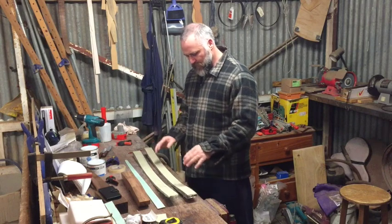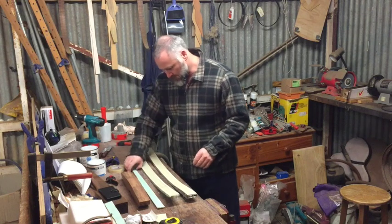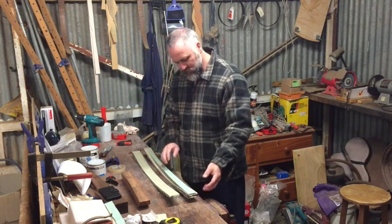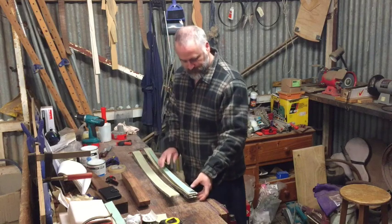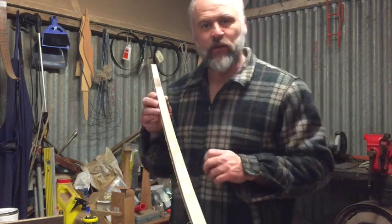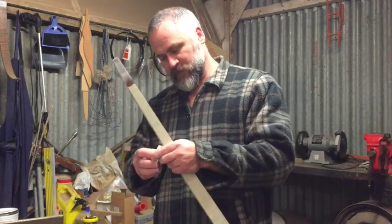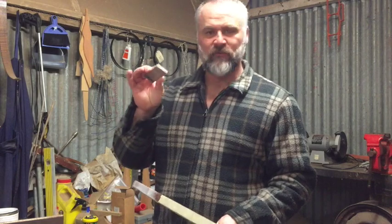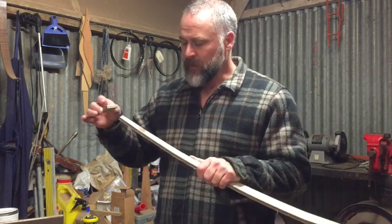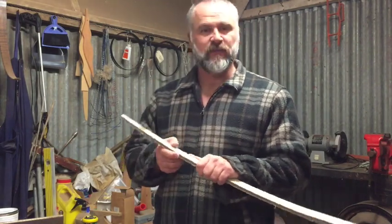Next I've got to cut out the limbs. I've traced the template onto those limbs and then cut them out — I've already done one. I'll attach the limb template to the second limb, trace it around with a pencil, then go and cut it out. I've cut the limbs out to a rough shape and peeled a bit of masking tape back on the end of the limb and roughed it up with sandpaper. The next step is to glue a bit of phenolic on the end of the limb to strengthen it, so when the string goes on and it's been shot, the string doesn't damage the end of the limb.